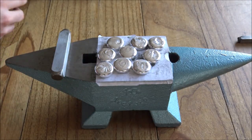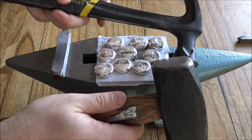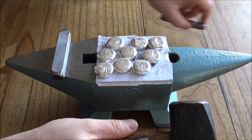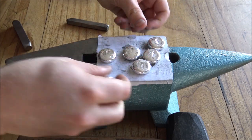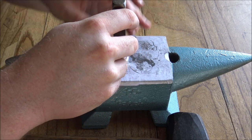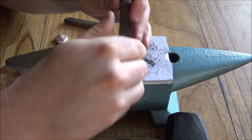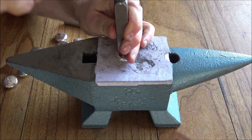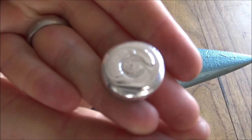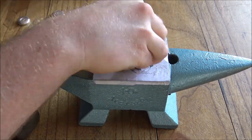The wolf is going to be left sticking out from the silver and the rest is going to be pushed down around it, so it requires this kind of big sledgehammer-looking mini mallet — it's a nice heavy one. You can use other hammers for smaller stamps where you need a bit more control, but this big one yields a lot more force through the stamp into the silver, which is really important for good purchase on the stamp and getting good detail and depth. We're doing them one at a time on the blanks, otherwise they'll go flying across the room. Very important: ear protection, because there's a loud bang. Just two swift strikes there — with experience, I can tell when it's okay to strike twice in a row quickly. You can see the nice depth that's gone in, so I'll fast-forward through all of these.